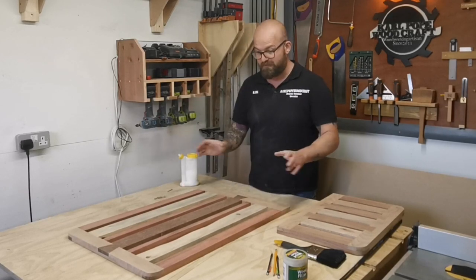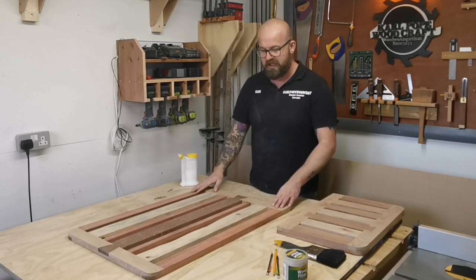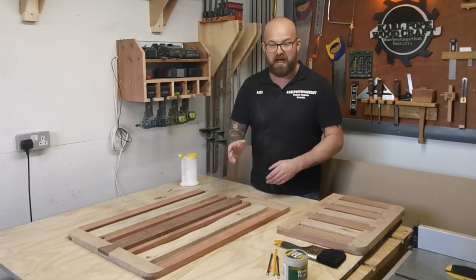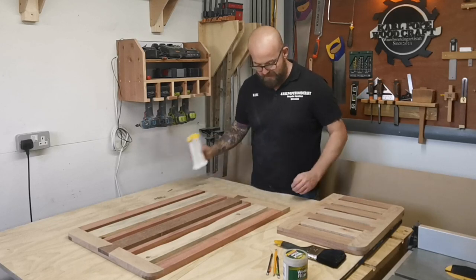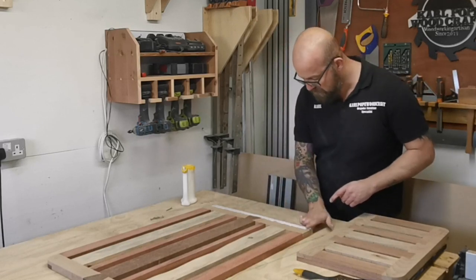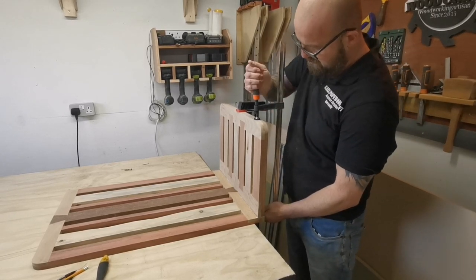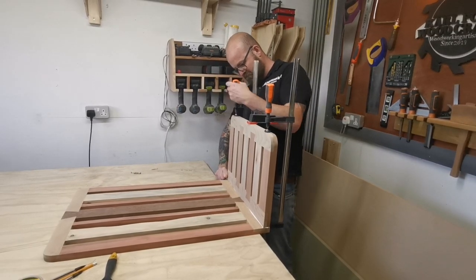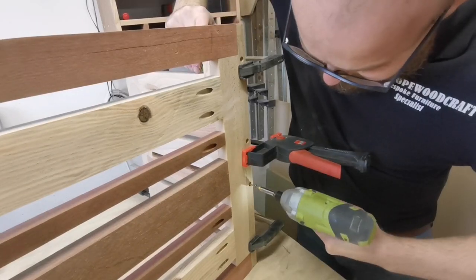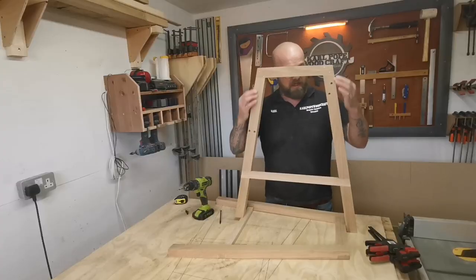We're at the assembly stage now — really exciting part, fingers crossed everything goes to plan. I also want to add a little round over on all the edges that are going to be touched by hand. I'm a little unsure where the joints are going to cross on the frame and the seat, so we'll wait to do that until it's assembled. I clamp the seat firmly into position while I add the screws in from the rear of the seat. Make sure to pilot hole before adding screws — with hardwood this will split really easily. To attach the seat to the frame, I first mark out from the diagram where it's going to go, then pilot hole and countersink.